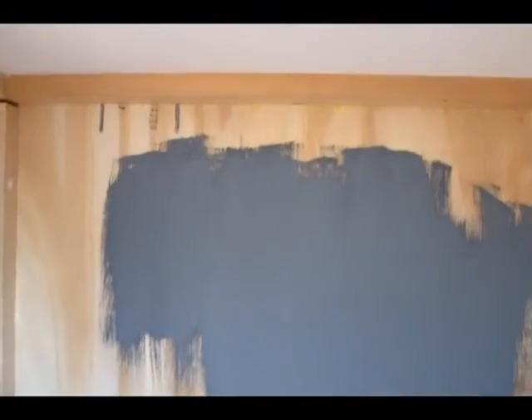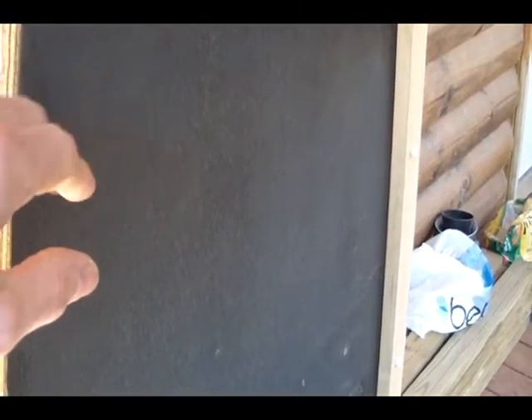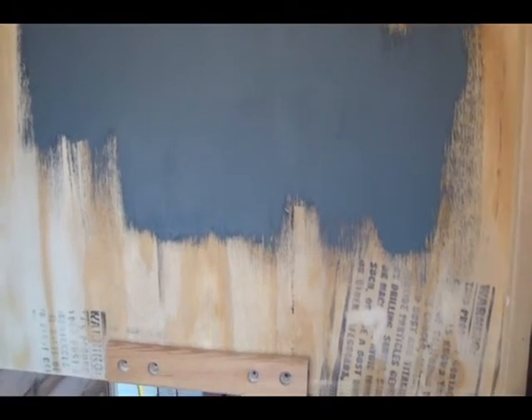Pretty much got the shelf for the monitor done. You can see some of it's real wet — some of it's starting to dry and some of it isn't yet. I started doing a little bit on the upper inside of the back there. I'm going to save the side since it's more porous — some of it was pretty porous here. We want to save the porous side for near the last, just in case there's any residue or anything splintering from where I was sanding. These newer panels are a lot more dust free; I've blown it all out, but I just want to be careful.